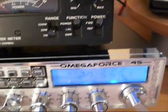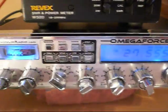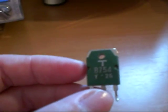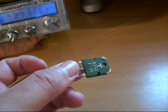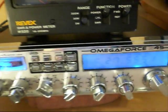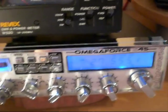It is not the later MOSFET version, thank God. Now the problem with this radio was that the main output supply regulator — this part here — which is a 2SB754 made by Toshiba, commonly used in many of these high-powered Uniden clone radios, was blown. Basically the variable power control on the radio was having no effect, so the output was fixed at around 30 watts and you couldn't adjust it at all.